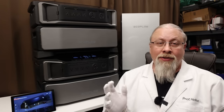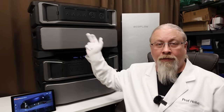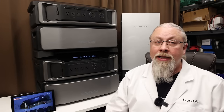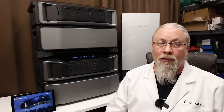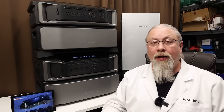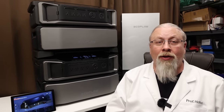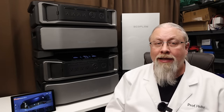Here's all the equipment I'll be installing over the next few days. We first have a pair of EcoFlow Delta Pro Ultras with a total inverter output of 14.4 kilowatts at 240 volts. We have a pair of 6-kilowatt-hour batteries to go along with it, giving us a total of 12 kilowatt-hours available — and I will expand on this capacity later.